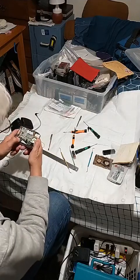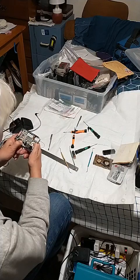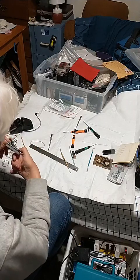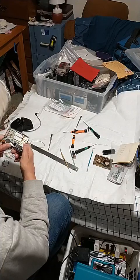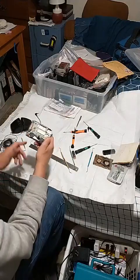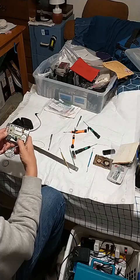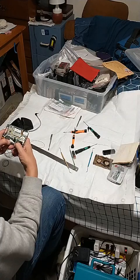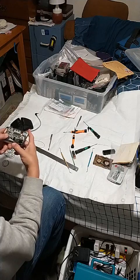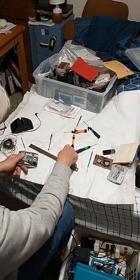Is it going to rub? We have it on there. Will it rotate? It will rotate, but — this belt is physically too big, because it's rubbing. I really need to have the right belt for this, because this belt, while it goes around and straight up alongside here, when it goes around the other capstan here, it's rubbing against the other half of the belt coming around to it. I can move it with my finger, but it's definitely rubbing. I'm going to take this off.